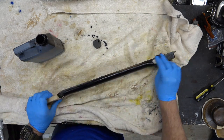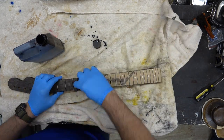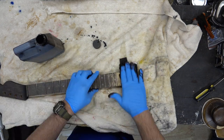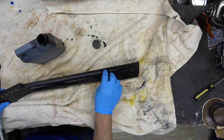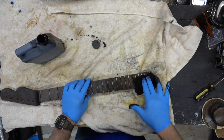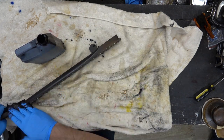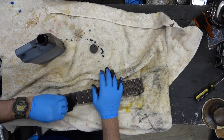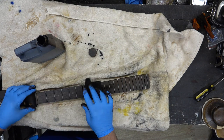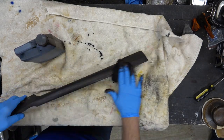Then we'll move to the neck. I already have all these necks built — I went through and did a whole bunch of different necks a while ago but didn't film that. What we're going to do is use this Angelus black leather dye and get it to match the vibe of the body. We'll get some black leather dye and stain the neck, doing two coats to get the color to even out. I'll have a black neck, black hardware, black vibe before this guitar gets all matched up. I'll make sure I get this into all the little fret nooks and crannies — I glued the frets in, so I want the dye to penetrate properly.